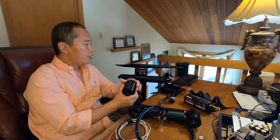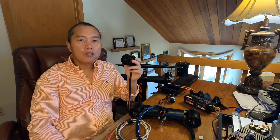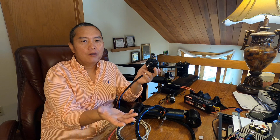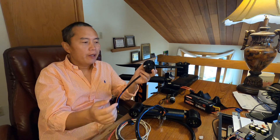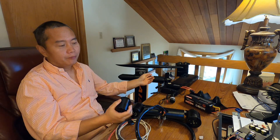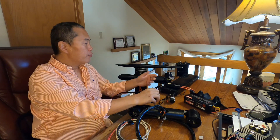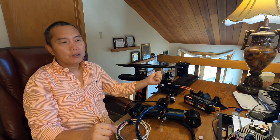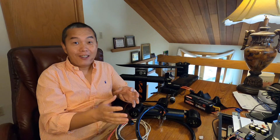This single motor here is much bigger. If the motor is rated for 48 volts and you use only 24 volts, you basically lower the performance — the motor can perform much better at the higher voltage. So what I'm thinking is I need to increase the voltage for my single motor. My dual motor is rated for 24 volts so that's fine, but my single motor is actually rated for 48 volts, so I want to increase the voltage to get the best performance.